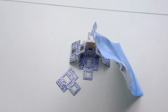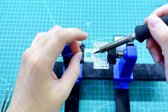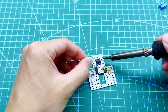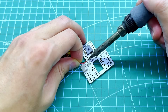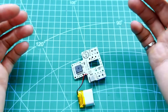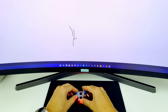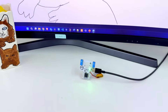Now that we have our new circuit boards, it's time to place the components onto the PCBs — let's get soldering! I made the dumb mistake of soldering the microswitches backwards, which was not a fun time to fix. After turning it on and doing some quick tests, the mouse moves and clicks properly, and the battery charges as well. This is looking great — can't say the same for my drawing.